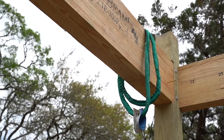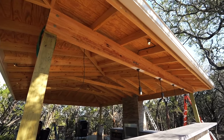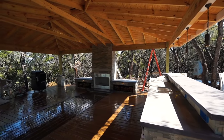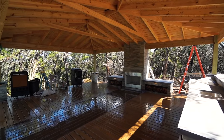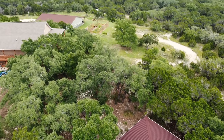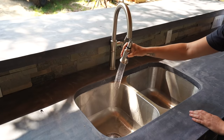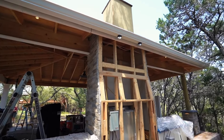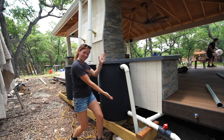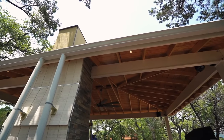Big things to consider when building an outdoor space like this: where are you going to get power and water from? Bringing in utilities can be expensive, so be sure to factor them into your cost, or factor them into how you pick the location for the structure. I picked my location based on already having power underground — I originally thought to put it closer to my shop, but then I would need to rock-saw trench a new power line to it. Water is easier if you're fine with rainwater collection. I'm literally collecting rain right off the roof, and that's what feeds the sink to wash dishes and hands. If you want to make it potable — meaning drinkable — there are options for that too.